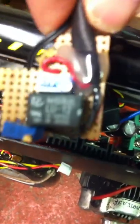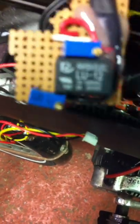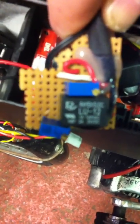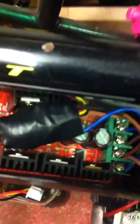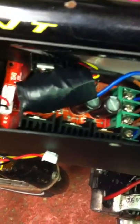This is a very ugly piece of veroboard with some very bad practice on it, but I had this relay — 12-volt relay, coil resistance is 700 ohms. I've wired that in series with a 2k adjustable multi-turn pot, and that's going to be powered off the business end of the controller — naught to 20 volts. So essentially we'll get a switching point, but I can increase the resistance so that the switching point moves to a higher throttle position if it ends up being too low.